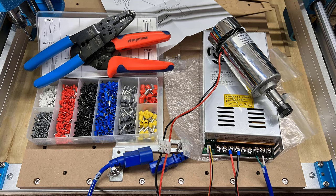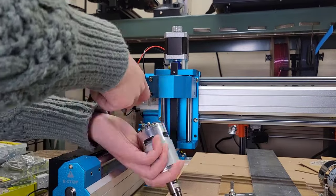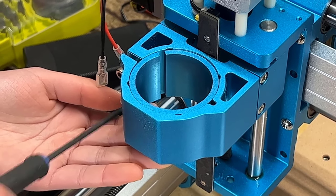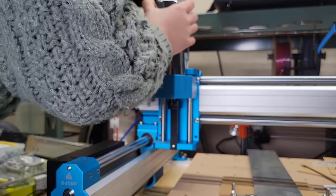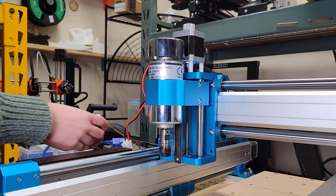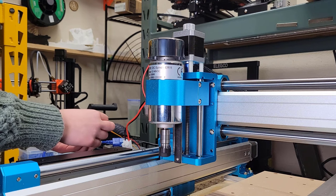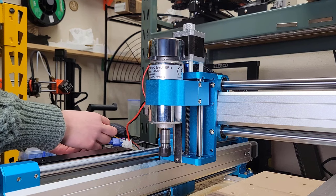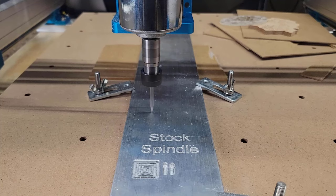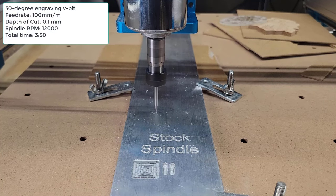Then, I will change the spindle to a 300W one. I need to work with some wiring and clamping ferrules. I will remove the stock 75W spindle from the mount. The mount is actually 52mm, so I just need to remove the washer and directly put a 300W or 500W spindle on this machine. As the 300W spindle comes with a 48V power supply, I need to control it manually using the knob to adjust the speed. Since I mainly use this to mill aluminum, I will turn it all the way to the highest speed, which is 12,000 RPM. I will try the same engraving with the new spindle, using 100mm per minute and a 0.1mm step down.